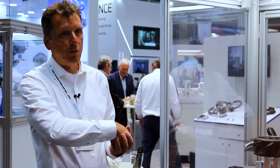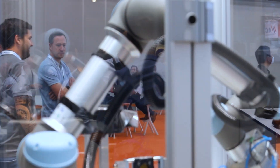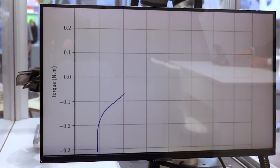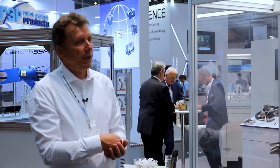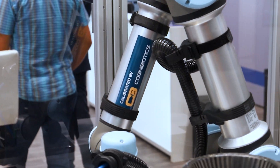Then we perform a cycle of torques on the different joints and see the response. So it's not only a kinematic model, it's also an elastic model of the robot. This means we can also cope with the displacement due to the payload if it changes during production.